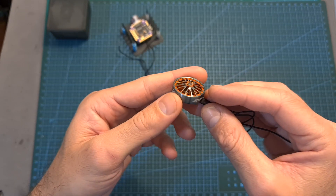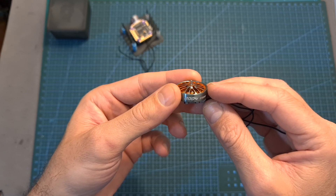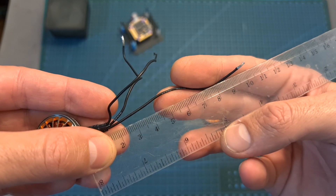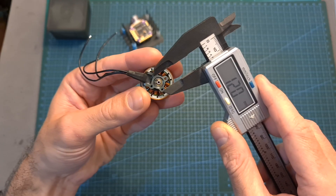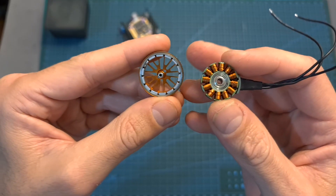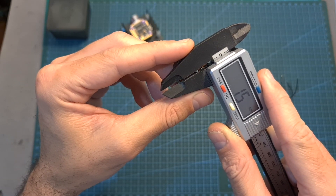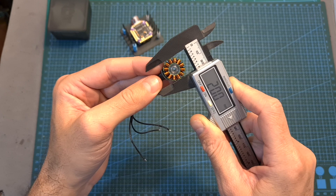Now let's move on to the Mamba Toka 2004 motors, which are going to be available soon. They come in 2 KV options: 1700KV which supports up to 6S batteries, and 2900KV which supports up to 4S batteries, both when spinning 5-inch propellers. The weight of the motor, including the 10cm long 24-gauge silicone-coated wires, is 16.6 grams. Its motor base is 12mm. The motor bell is secured using a C-clip, and here you can see what it looks like after separating the motor bell from the stator. Inside the motor bell you can find 14 magnets. The inside motor shaft diameter is 3mm and the outside motor shaft diameter is 1.5mm. The stator height is 4mm and its diameter is 20mm.